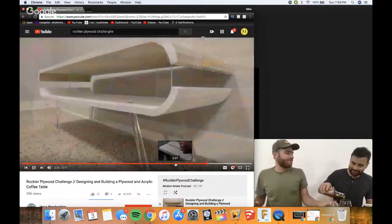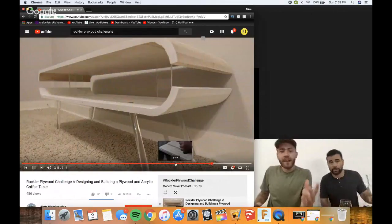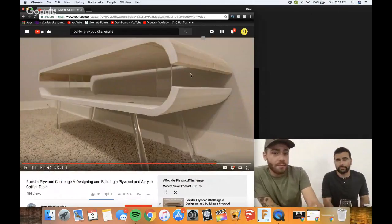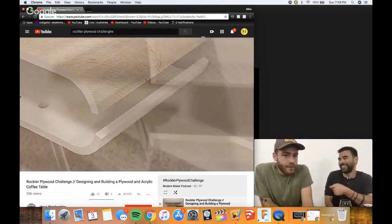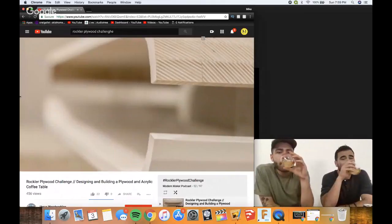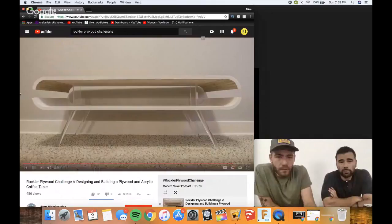That's it. I made the bottom in the same way I made the top. I just didn't show it because it was painted. That's incredible. I especially like the acrylic that separates the top and bottom. I just drilled 15 holes at an angle and glued them in. The acrylic was cut to length so that the curve at the ends was seamless. And I glued those together in a chevron pattern to give the table stability. I like this project a lot.